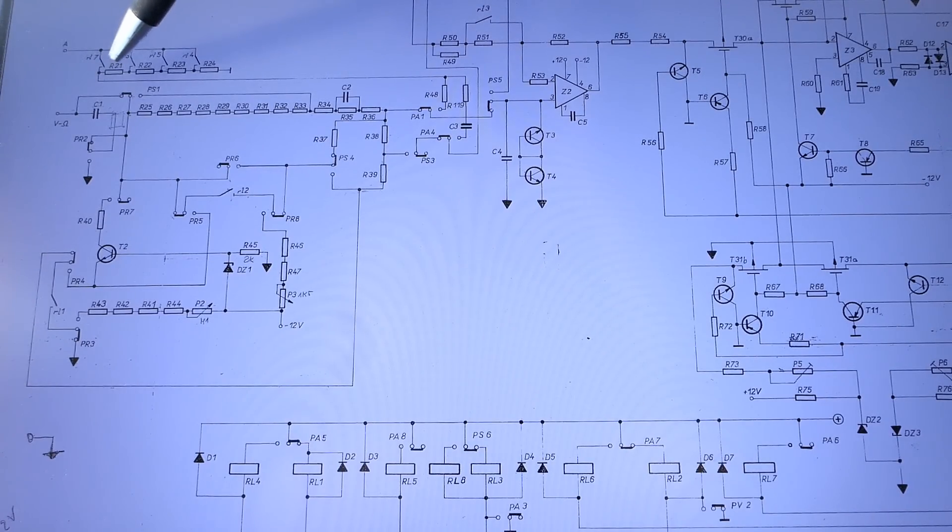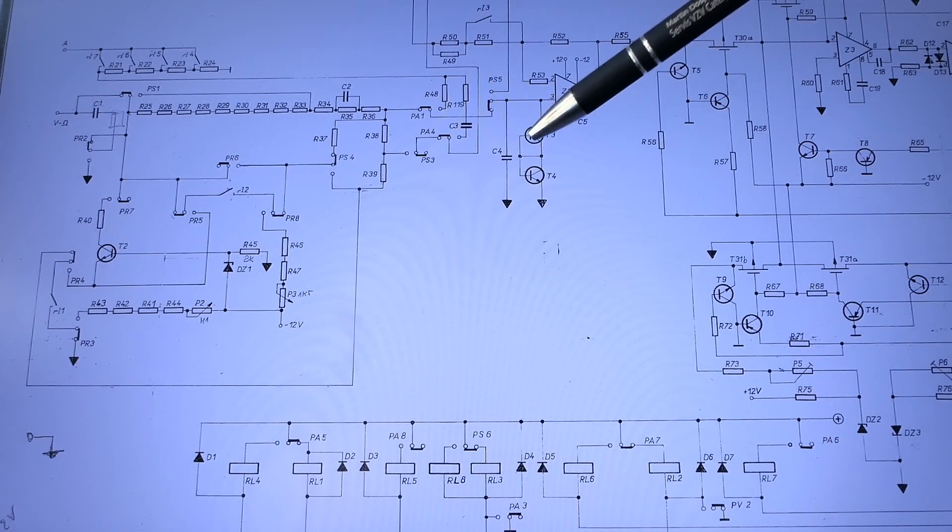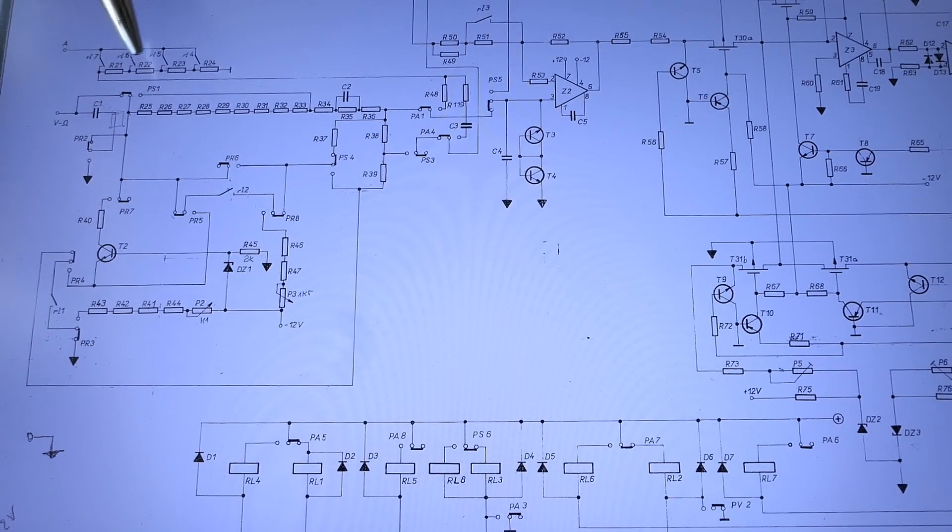Here is the common ground input, the voltage and resistance input, and the current input. The current input has four current sensing resistors switched by relays. For the highest current just one is used. For the next range these two, then these three, and for the most sensitive range all four in series. But even if just one is used the signal still goes through the other resistors — which means if this resistor is open then none of the ranges works. I hope just the resistors are blown and not some circuitry. Is it some sort of over-voltage protection?